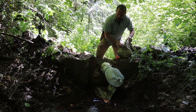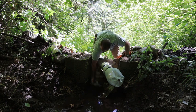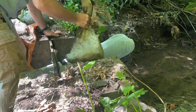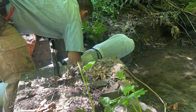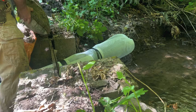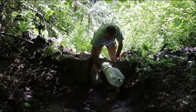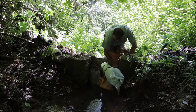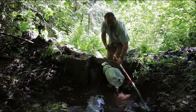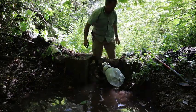I've got old feed bags and torn-up old sandbags we'll throw into these corners — anything we can to seal up around these edges. As I'm finishing up the blockage here, the pipe is a couple feet off the ground, way back towards the back wall of the dam, with a lot of space in front of it for water to fill up. This is a very silty creek, and as the summer goes on, this entire pond will be almost completely full of silt. When I take the gate out at the end of summer and the winter rains come, it'll flush back out, and then I'll have to dig some out before I start using it again. But there's over a thousand-gallon pool here, and the silt will settle out in the calm water, which will help keep silt from running into the pipe.